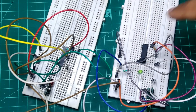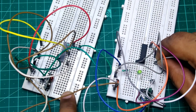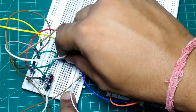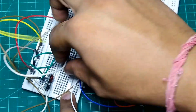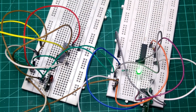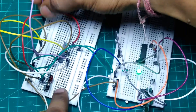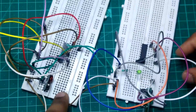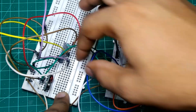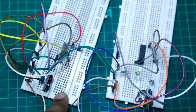Our RF is working. Similarly, connect an LED to pin 11, and then on the transmitter end connect pin 11 to ground and the LED turns off again. You can do this for pin 12 and 13 as well. So we can connect 4 outputs at the receiver on pins 10, 11, 12, and 13, and 4 switches as input on the same pins on the transmitter. Whenever a switch is pressed to ground it sends an off signal to the receiver, otherwise it sends an on signal.